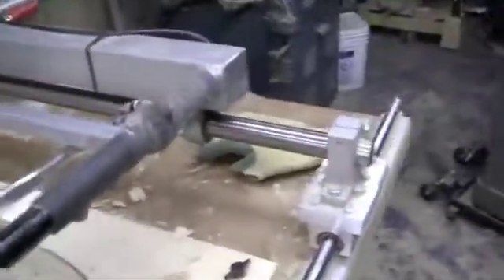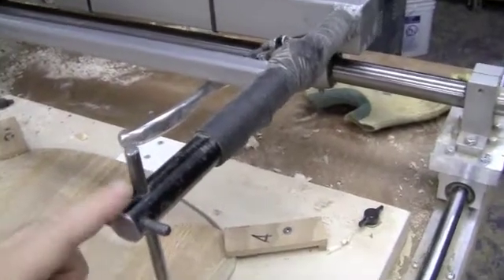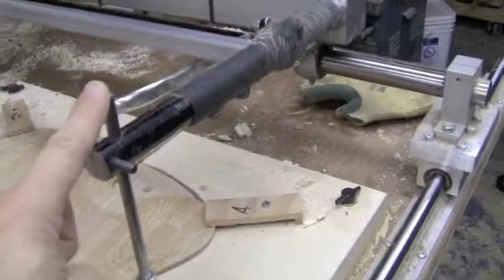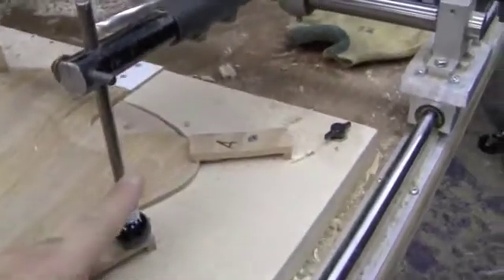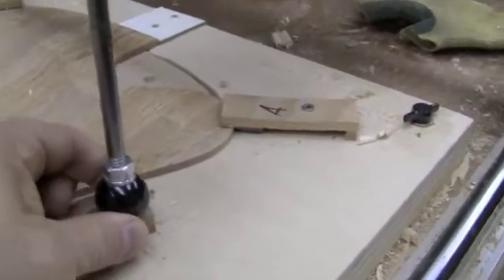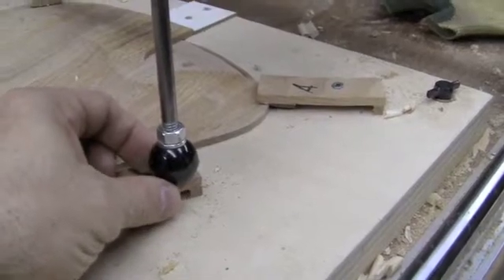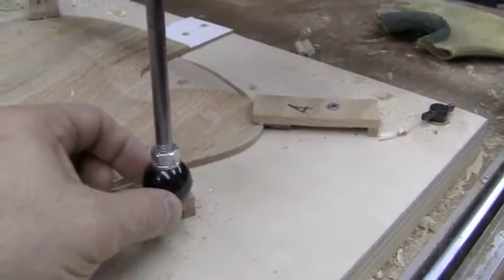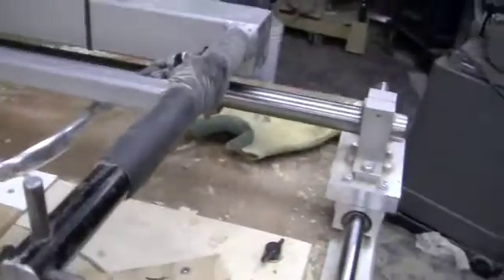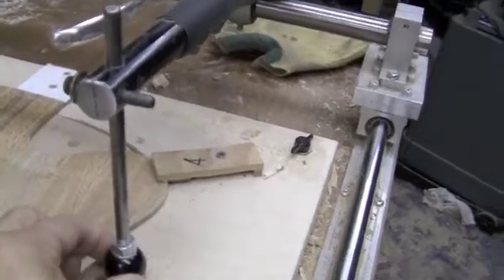Within the steel tube I mounted a steel shaft. I drilled a hole through the shaft and then put on what I call a stylus — the stylus is a piece of quarter-inch drill rod which I cut threads on at the end and mounted a ball onto it. This ball is one inch in diameter and is exactly the same size as the router bit that I have at the other end, which I'll show you in a minute. I put on this adjustment screw so that I can move this up and down, and I'll show you why I would do that later.